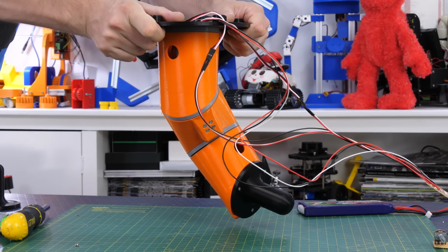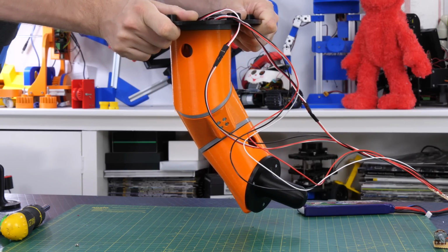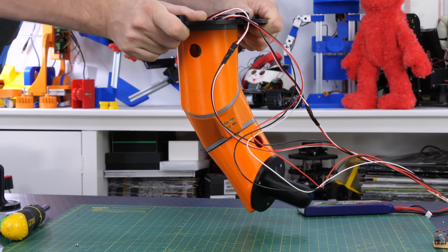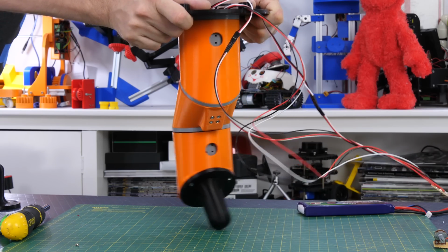So we've got 3 joints, the same as a robot dog, which can move in any direction in XYZ Cartesian coordinates, but with these 3 joints, we've got a lot of problems. Obviously my servos only move 180 degrees, but that's much more than the robot dog joints would move to achieve a better motion with the foot. So it looks like we've got some problems here.